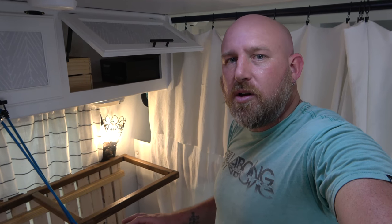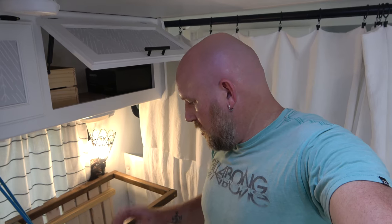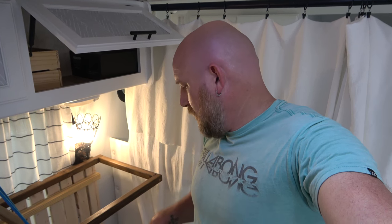That's the space I have to work with. I don't know that I'm going to be able to fit everything in there like I wanted to. We're going to be using two AWG gauge wire, and that's pretty thick and it's not very malleable in terms of making tight corners and twists. So I don't know if everything's going to go where I thought it was going to go. And I'll kind of show you the situation of how it would possibly be set up. Using plywood is great because I'm able to build a section where I can mount things vertically or even horizontally. And so I may need to adjust some of the things that I've built a little bit in order to hopefully fit everything in here with the right space. Of course, safety is the first priority, so everything is not at risk of starting a fire, of shorting out, or anything like that.